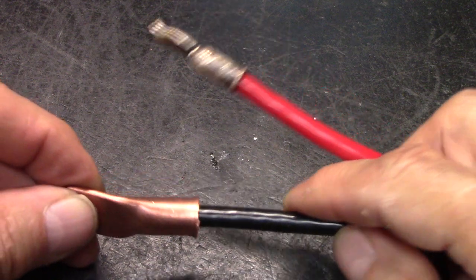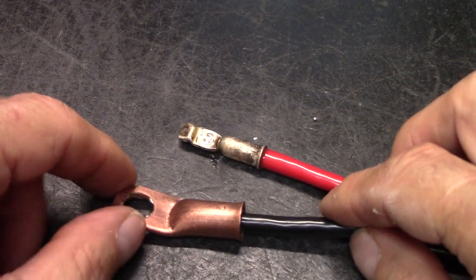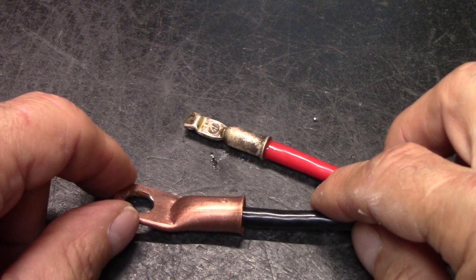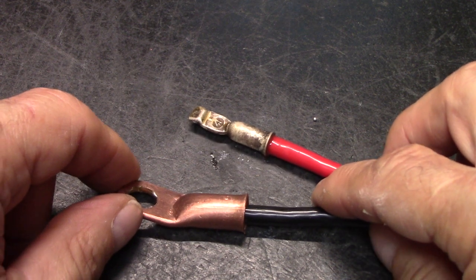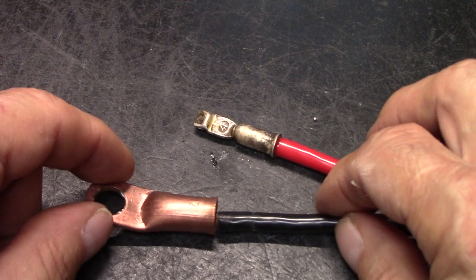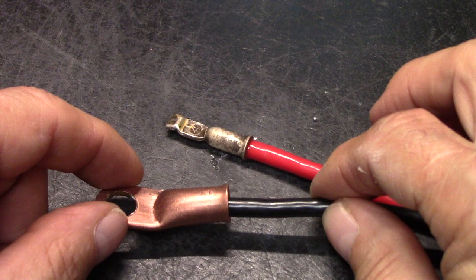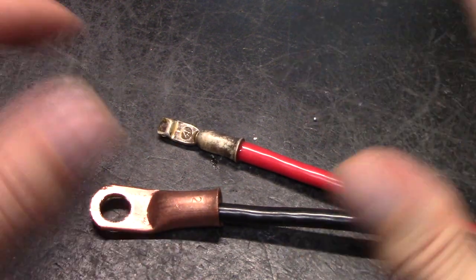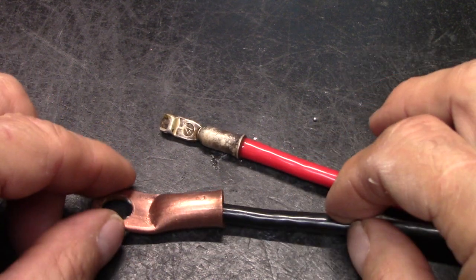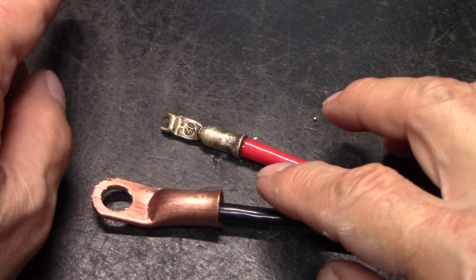If you have any resistance here in this ground, it doesn't matter if you use an antenna analyzer, half wavelength tuned coax to your antenna, which is exactly the same as tuning your antenna at the feed point. Actually, it's more accurate using a half wavelength tuned at frequency. If you have a bunch of shit-ass solder or shitty solder joint, or while you're soldering, you wiggled it, that's all it took. It's junk. You gotta start over again. Then you would have resistance here. So, therefore, your radio would see one ground, your amp would see another, and your antenna would see another.